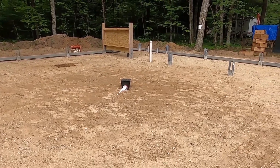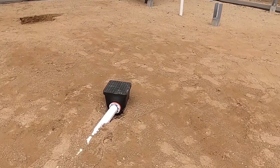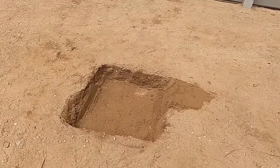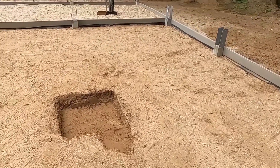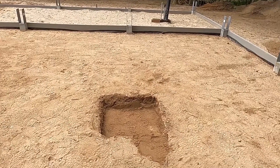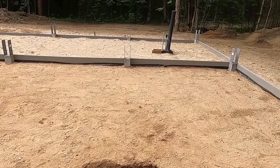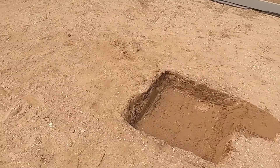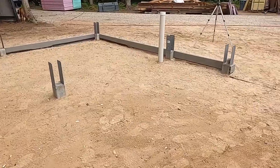The whole insulated area here is compacted and graded. The drain vent is installed and we've excavated a small area where we're going to put a footing pad. In case we ever want to add a loft in here, this footing pad can be used to support a header along with the two end columns. We don't anticipate using it, but now's the time to put it in.